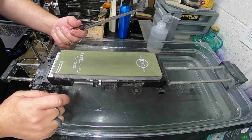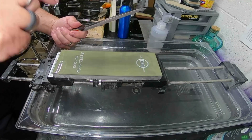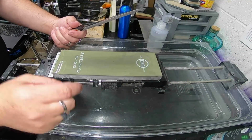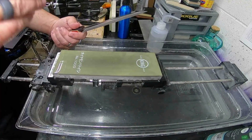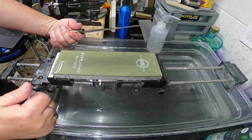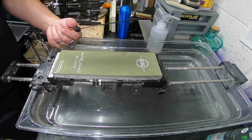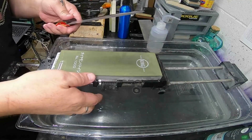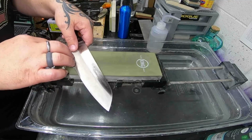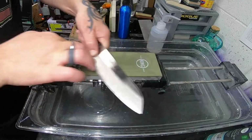I believe now you can get resin that has an abrasive binder with it. Most of them, especially higher grit resin bonded stones, are designed to have a binder that is not abrasive, because you don't want it to continue to cut your bevel when you're at a 6,000 grit, right? You want it to polish. Vitrified, it's going to cut. Now, obviously, you can get higher grits that aren't going to cut, but initially, like the 1,000, that's why those 1,000s are so awesome. They're actually cutting because of their binder as well.